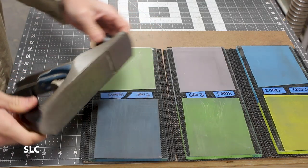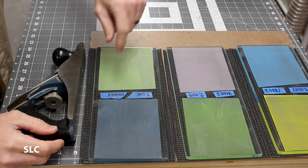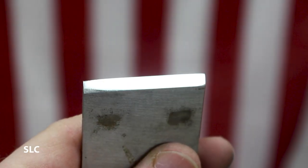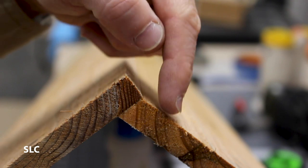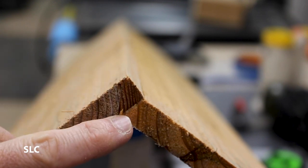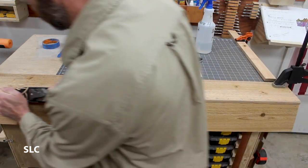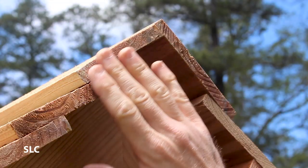I plan on using my hand plane to trim all of this down but the blade is definitely dull. I have a nice sharpening setup I picked up off Amazon — I'll put a link in the description below. It goes from 300 grit all the way up to 14,000 grit, so this should get it nice and sharp. That may not be perfect but it's a lot better than it was. If you notice this edge is not exactly lined up — that's because this is not a 90-degree angle here. I should have trimmed this angle the same as the other when I was cutting on the table saw, but I forgot. We're going to go over this with a hand plane real gently, and if it's not perfect that's okay — it's very unlikely to be seen anyway. Never underestimate a nice sharp hand plane — after a little massaging that looks a lot better.